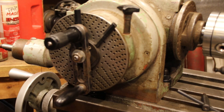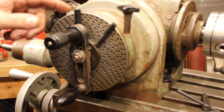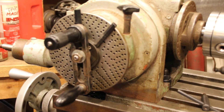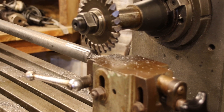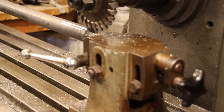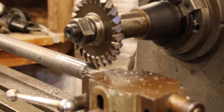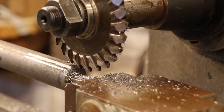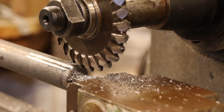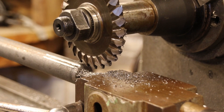You move your fingers over. You can see I'm in one hole — I've got 2, 3. So it's actually just 2 because you go 0, 1, 2. You'll get the hang of it when you start using the dividing head. We're going to cruise around there. The machine's kind of loud so I can't really talk over it, but we have our cutter. It's doing a perfect job on the splines. We're going nice and easy. We're at full depth — it's a 71 and a half thousandths depth. If we keep dividing that right, we'll have a perfect spline in the end.